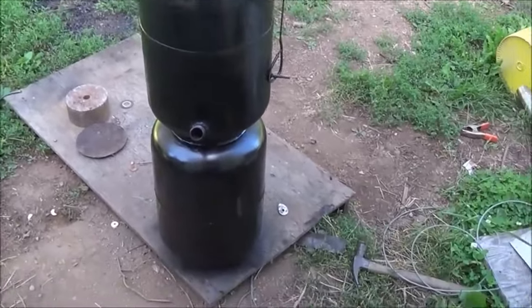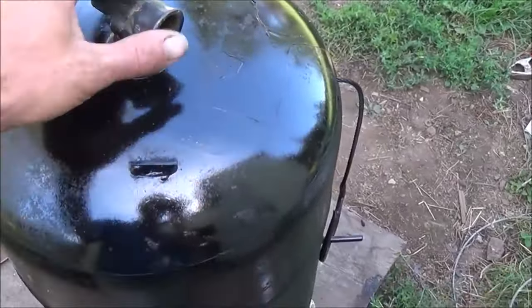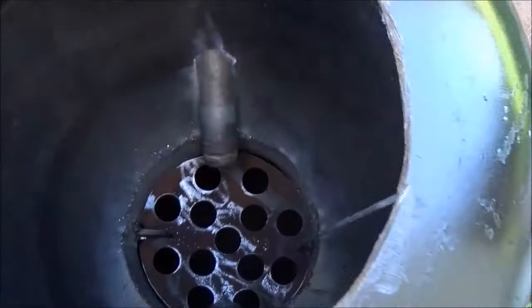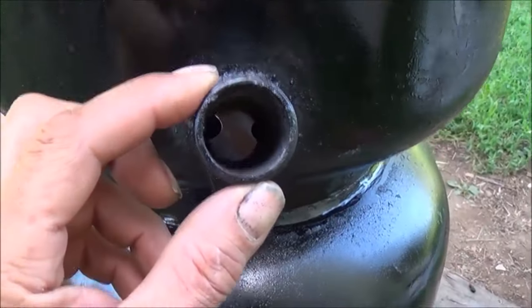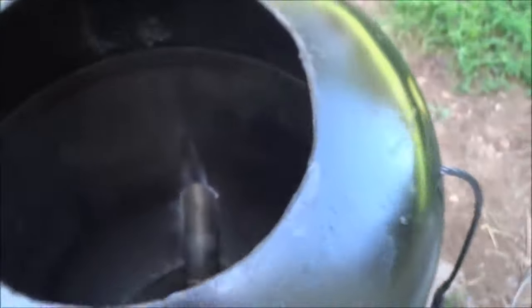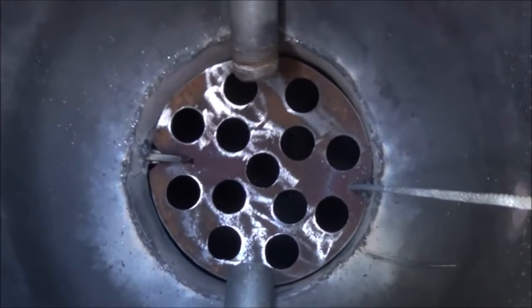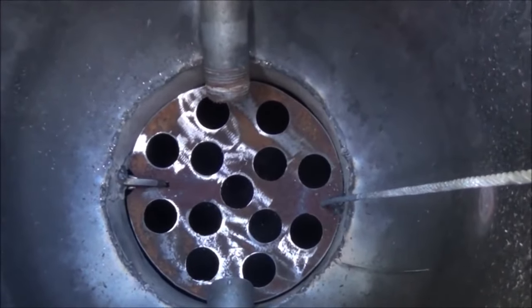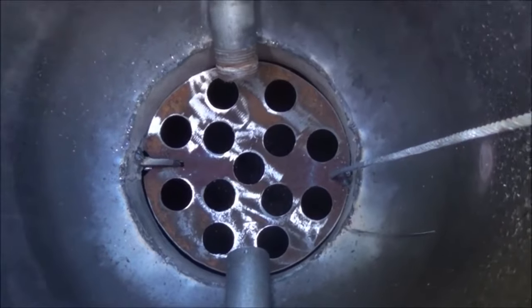I've put a coat of paint on it so my hands don't get quite so dirty — that's why I do this before it's really quite done. I've also used the other propane tank top from our previous gasifier project as our lid. You can see down inside of the gasifier now and see our air inlet pipes facing right toward the center. This time instead of doing eight half-inch holes, we've done two one-inch holes — a one-inch pipe six inches long going down in there, and right opposite of that another six-inch piece of one-inch pipe. They both protrude just slightly out over the edge of the reduction zone, extending toward the middle, which allows a more direct burn right down the center of the column.